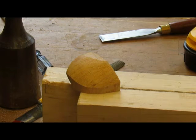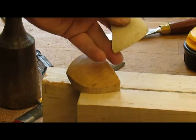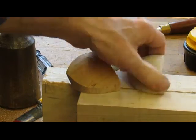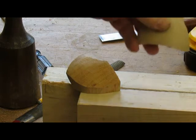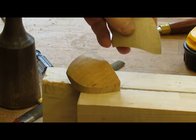I'm shaping the knee block on the odd side where the 45-degree angle is. I had made one that didn't come out very well, and then I had Doug Mulder come over and we chatted about it and he made some suggestions. So I made one out of soft maple that I had laying around the shop, and this one fit very well into that shape. Once it's glued in, I'll show you how we'll round the knee over to meet this knee block.